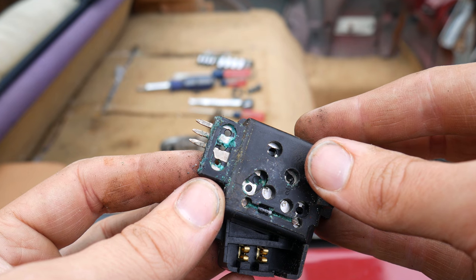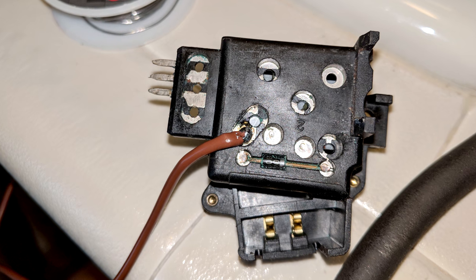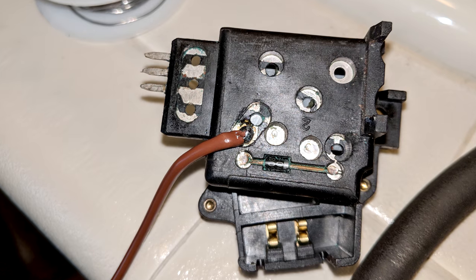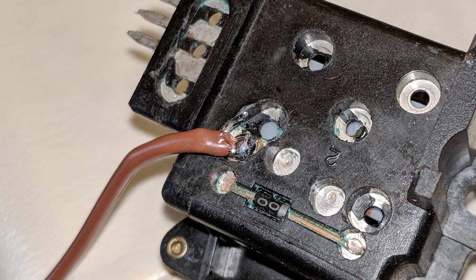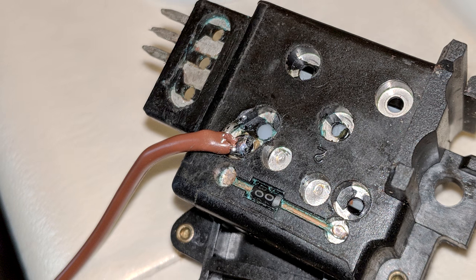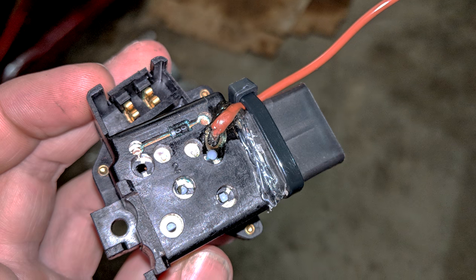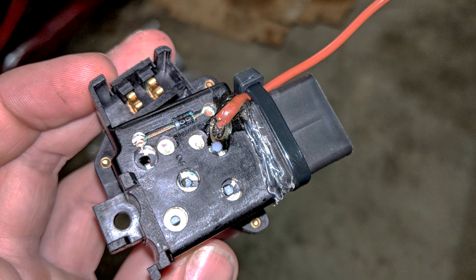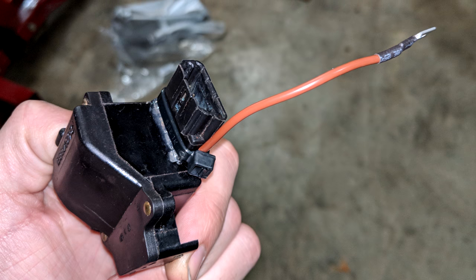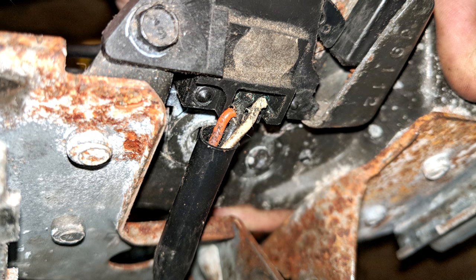Here is the bodge wire I ended up installing. I couldn't think of a good way to just fix that one pin, so I figured the other three connections will go through that same four-pin connector and outside of that we'll use a single-wire connector for this fourth lead. It's definitely not an ideal solution but it was the best and easiest way I could come up with to save the switch. Once the wire was soldered onto that trace and we tested to make sure we had a good connection, we applied a little bit of epoxy to make sure that wire was going to stay put, and threw in a zip tie for an extra layer of security.